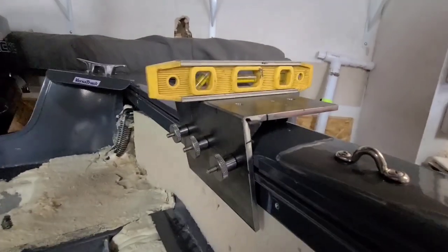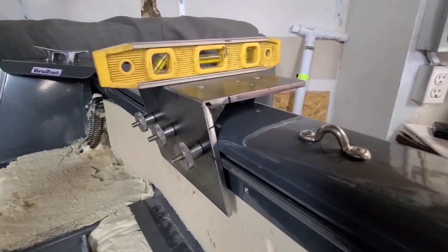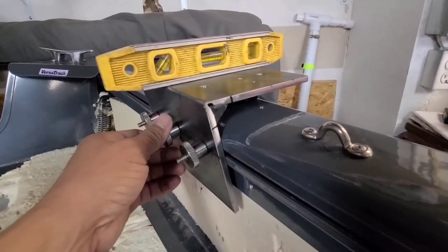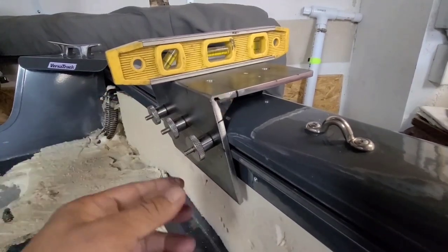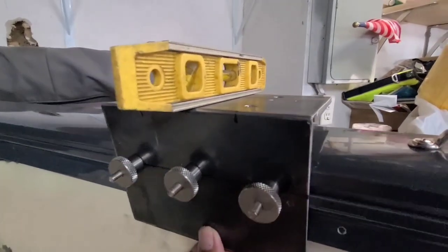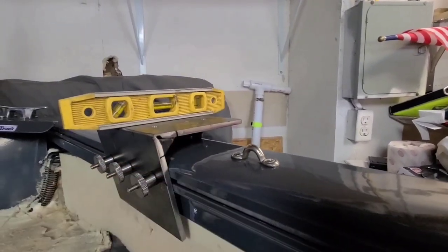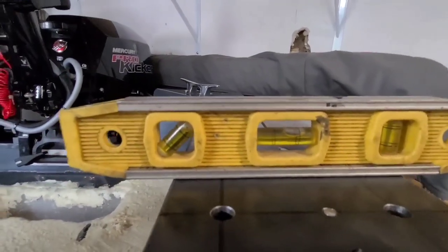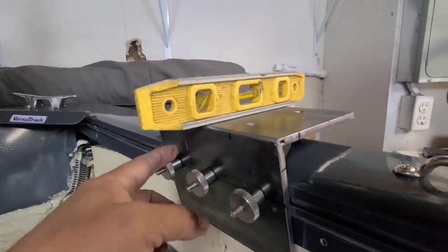Here's the finished product of my base plate, which is the most important plate — the starting point of everything else that stacks on top of it. It's very imperative that this plate sits as flat as I can make it. These are the knobs I'm using to hold it in place — three stainless steel knobs, solid. The stopper is sitting where it's supposed to sit. The level as it's bolted down is a little high on the right side, but once you start welding it's going to move a little bit.